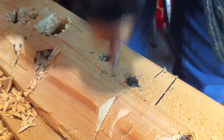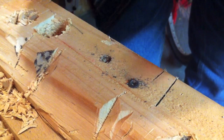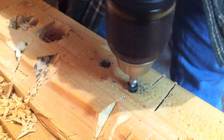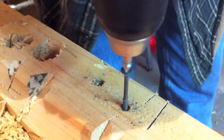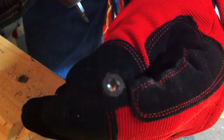You know you're down far enough when you can hear the drill start to get a lot easier — that's a good indication that you can flip the bit over and it'll take the screw out. Again, you can see how far it goes down there and actually takes the screw out.